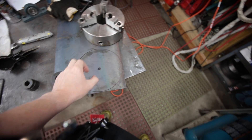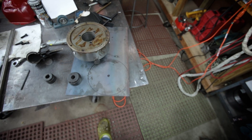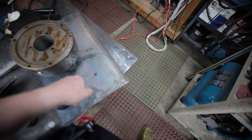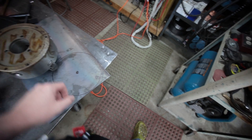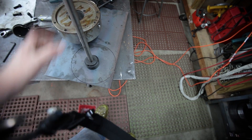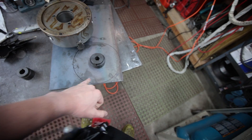If you have a lathe this would be really easy to do, but I don't have one yet. I've got one of my little pulley adapters here — this is going to go from the shaft to this piece of 5/16 plate. This chuck has three mounting bolts on it that you mount to a tapered flange on a lathe. What I'm doing is I'm going to cut out a round piece, bolt it to the chuck, and then weld this piece in the middle and have my shaft attached to my flange like that.